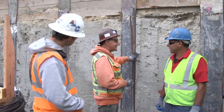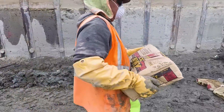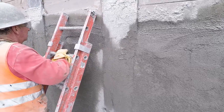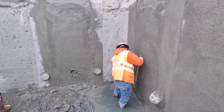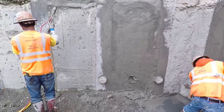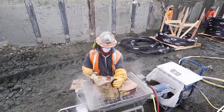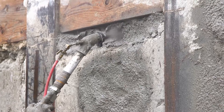With the soil mix, the finished product has a rough finish to it, so we use a stucco application to finish the interior of the soil mix wall so it's a nice smooth finish and the waterproofing can adhere to it properly. We normally apply the finishing application a piece at a time with a bucket by hand. Now we're able to use this pump and mixer to spray the wall much faster and get a lot more area done with fewer people required.